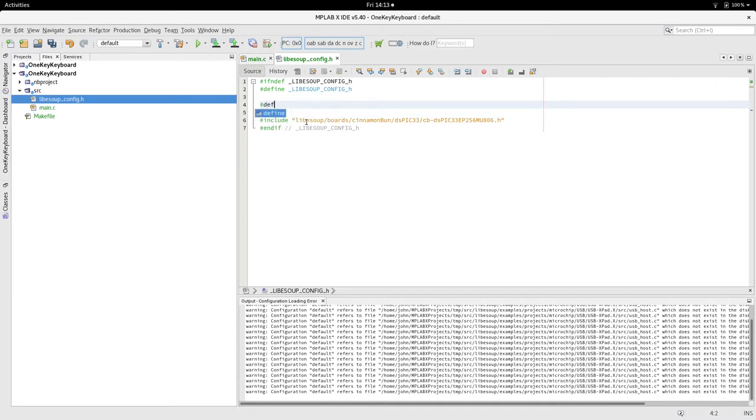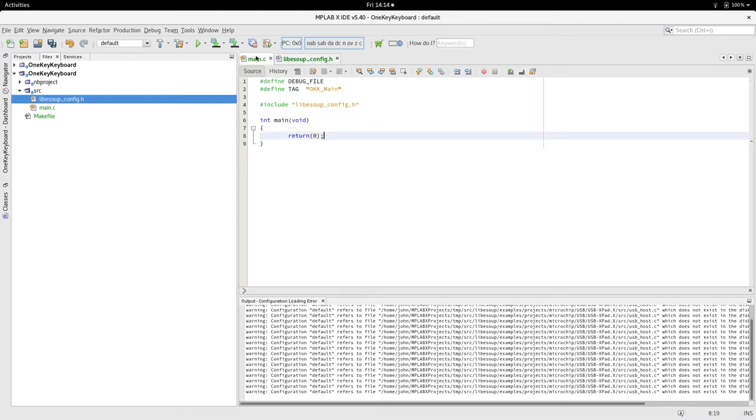We also need to define a clock frequency. The crystal on the device is a 16 megahertz crystal, but the microcontroller has a phase lock loop to increase that. I usually go with 60 megahertz, which is kind of like the max. So that's a start, defining the hardware that we're going into and the clock frequency we want to run it at, and we've got a main function.